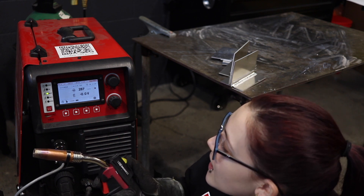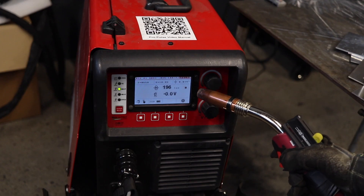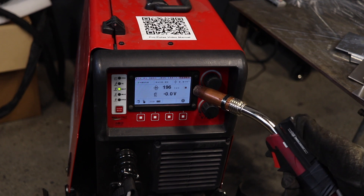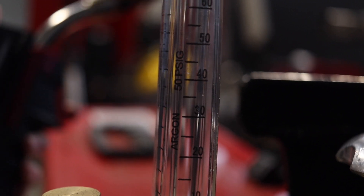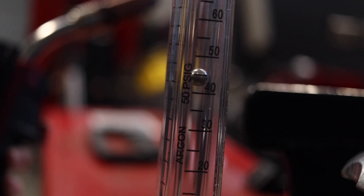And when I push up on the slider, you can see these settings go up as well. If you look closely at the display, there's a red and black R. This red and black R indicates that you do have a remote control attached right here on the machine. You want to be running 100% argon gas between 40 and 50 CFH because we are in Pulse Spray Transfer. Here you can see I'm at about 42 CFH.